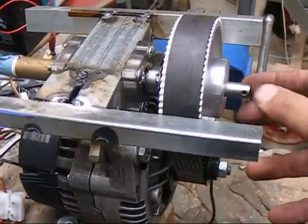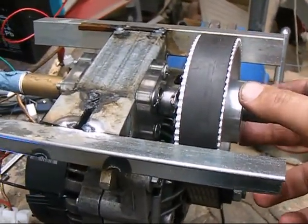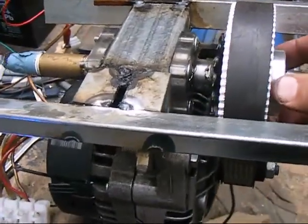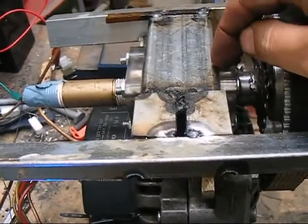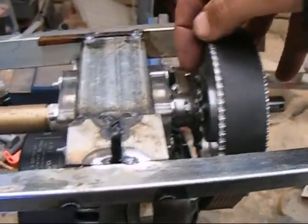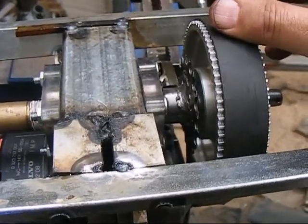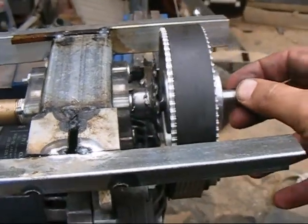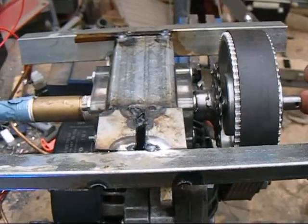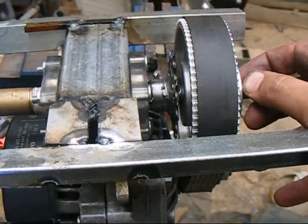This shaft here is turned down to half an inch at this end so this pulley can slide onto it, and that was done under quite a lot of pressure from a hydraulic press. It's 15mm in diameter to pass through these bearings, and at this point where I've mounted my homemade sprocket flange it's 16mm — the original diameter of the shaft, which actually came from a sack barrow — that's the axle between the wheels. Nice and cheap, readily available, and quite handy for this project.